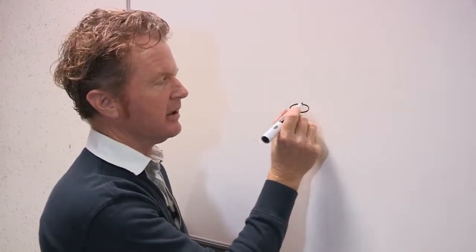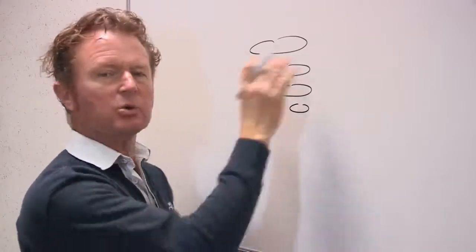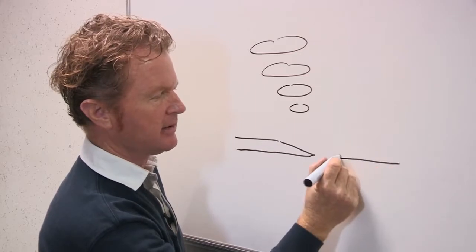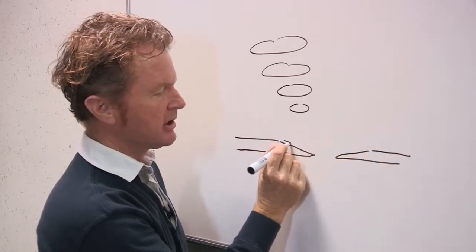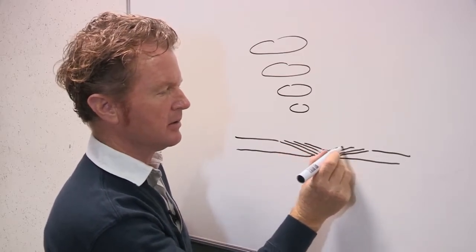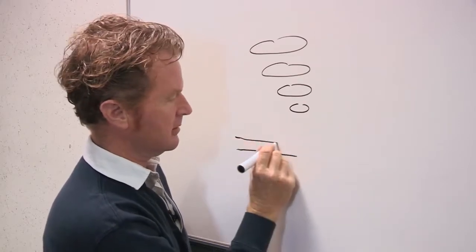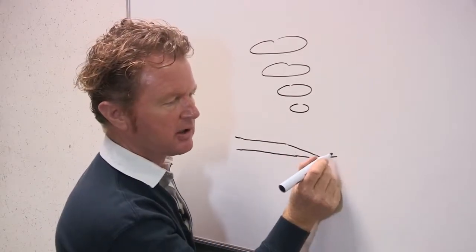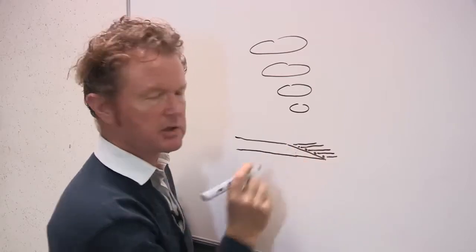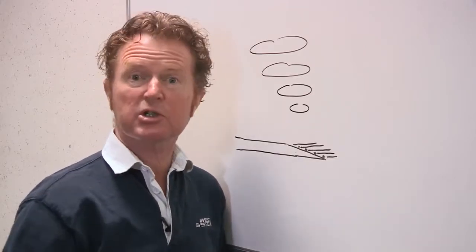You now have a series of four different sized patches in total to build up to our laminate thickness. You might ask yourself which order do these go in? Well, they always go with the biggest patch first. The reason we do that is because the biggest patch gives you the maximum contact surface. If you go with the smallest patch in first, you only ever get the edge of each individual patch contacting the surface, and what that does is create a series of air bubbles right at the interface of the bevel joint — and that does not produce a good repair.